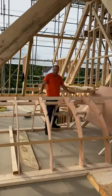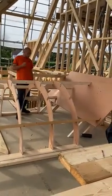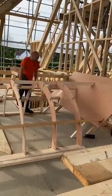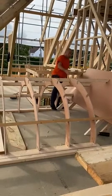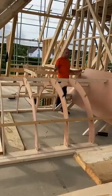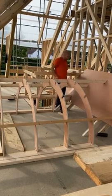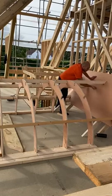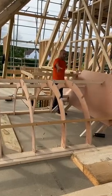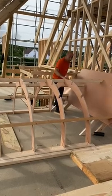I also like to make it up on the floor, and whatever the pitch is, I'll work up against the wall, and then when I've got my timbers to go through, I will slide them through and scribe them. We don't want no steps, bulkheads or anything inside the dormer, so I've got to make sure it's consistent all the way through. So when it's all in, we'll mark the bottoms, allowing for the noggin underneath. And we'll draw another semicircle ply, which will go as our lay boards, when this all gets fixed now.